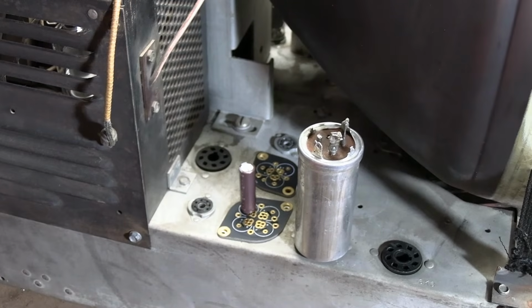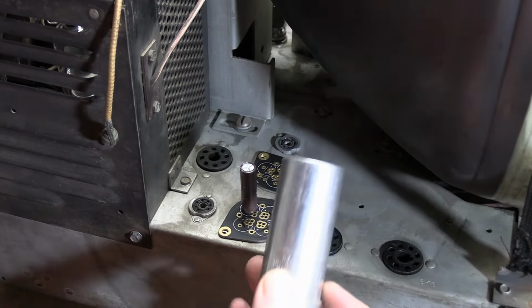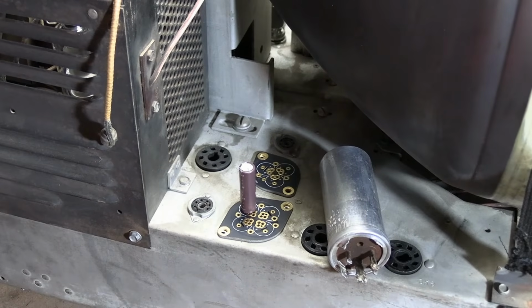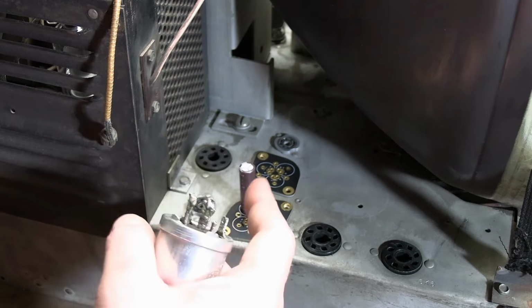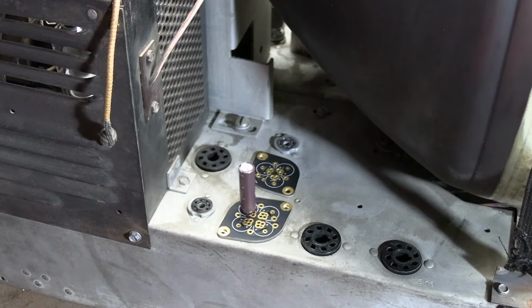Alright, so yeah, I have in the past, but here's a few things to consider about doing it. If you completely seal the new caps inside of this, a few things. One, if you ever need to replace one, you have to tear it all apart again. Two, if you think there might be a problem, you can't see the caps. You have to, again, open this up or test it from down below. With this, if a cap was to rupture, I would obviously see it. The top would blow out or something. If I need to replace it, I can very easily get at it.